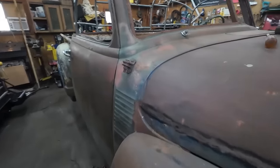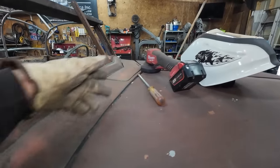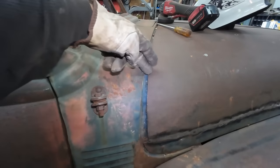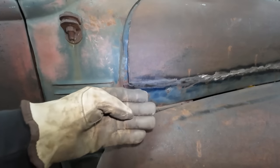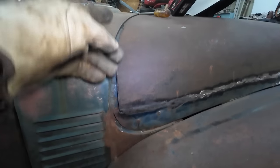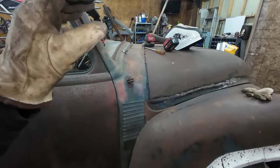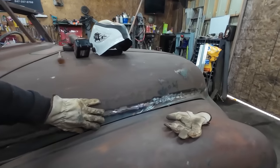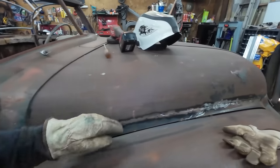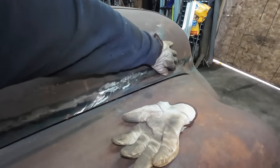So we're just going to paper pattern this. I don't mind this gap, so this is fine. So it's probably going to be from about here to down. Even this is not terrible once we get this spaced out, because it's tucked in a little bit there. So we're going to make a little sliver, burn that in, and then we will quickly jump to the other side, do the whole same thing again, try to burn through that super quick, because I'd like to get these edges made and then probably run this through the planishing hammer to straighten this out.